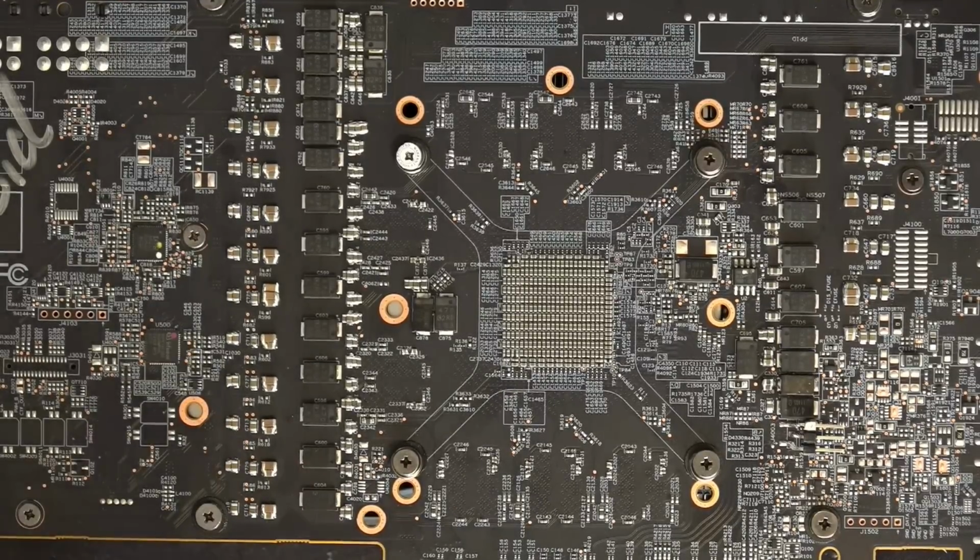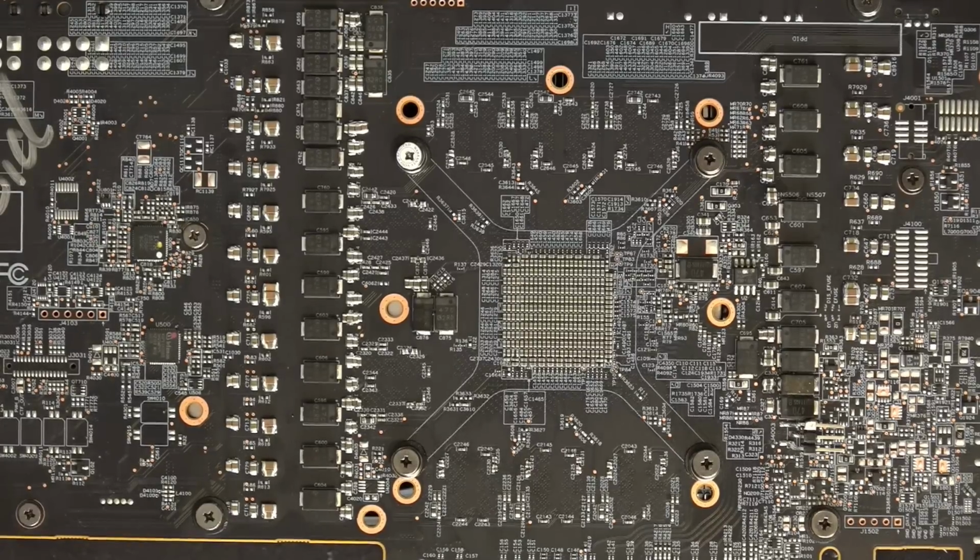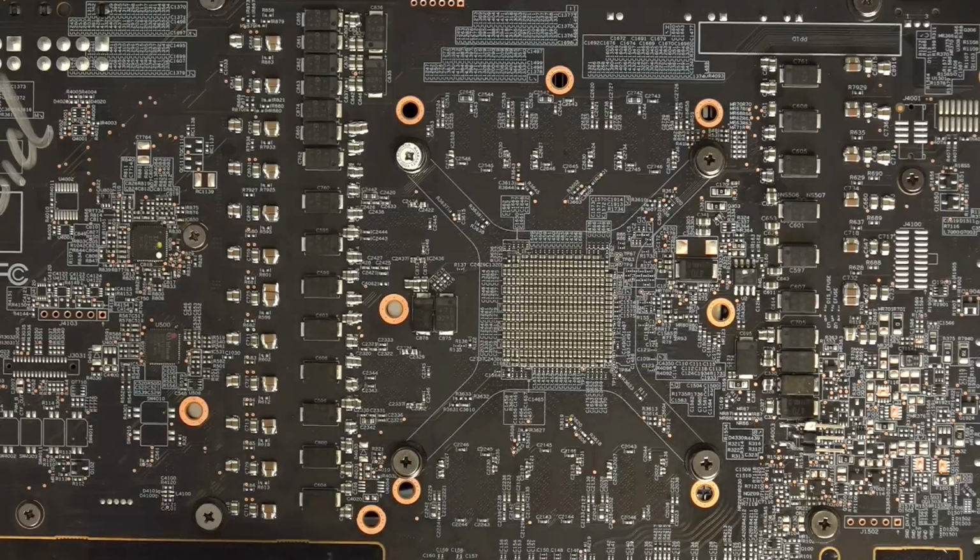You can also get that effect on 290Xs if you push them really, really hard. Actually, a lot of AMD GPUs will do this thing where if you push them far enough, they'll just stop rendering whatever they're supposed to be rendering. You'll get a black screen, and you'll probably still have an FPS counter, which is really interesting. I guess 2D elements somehow don't get affected, like the 3D part doesn't get handed off to the display output, but the 2D stuff does. So you get a black screen with an FPS indicator, and from the FPS indicator you can tell it's not bugged out and not rendering anything, because the FPS doesn't shoot through the roof.